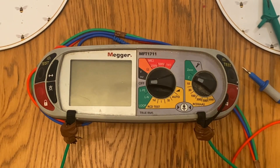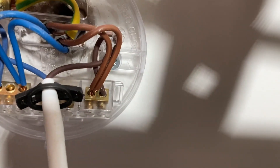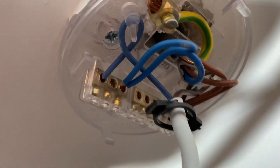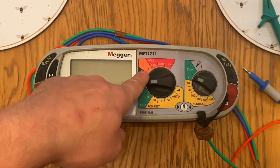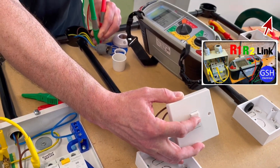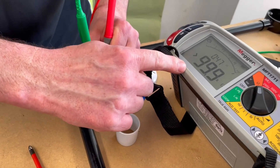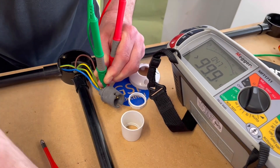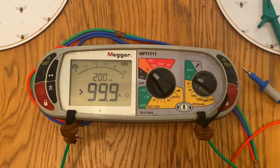The next dead test you're going to come across is polarity. Polarity can be done a number of ways. The first way is a visual polarity check, where we physically take off every accessory and check every conductor. But the main way we actually conduct polarity is along with our R1 and R2 test, which is our continuity protective conductor test using the low reading ohm meter. Whilst undertaking our continuity of CPC on the low reading ohm meter section of this multifunction tester, we can test at a lighting point between the switching line and the CPC, and we can operate the switch to confirm that the line conductor is being switched. We hope this video has been some help.